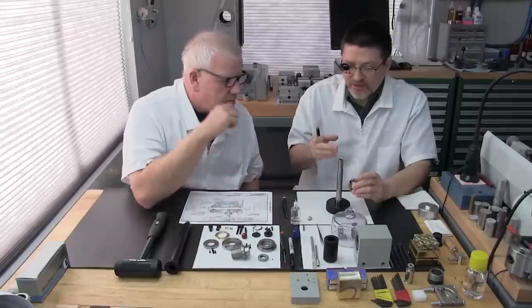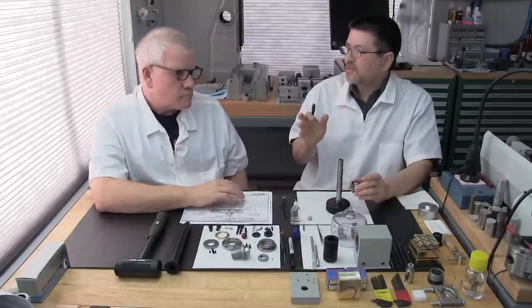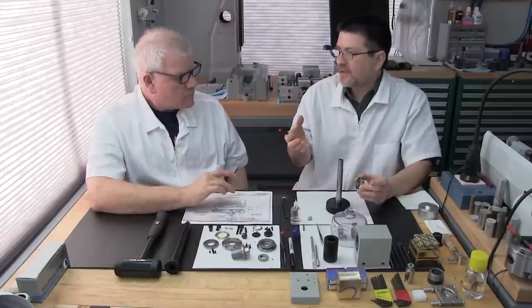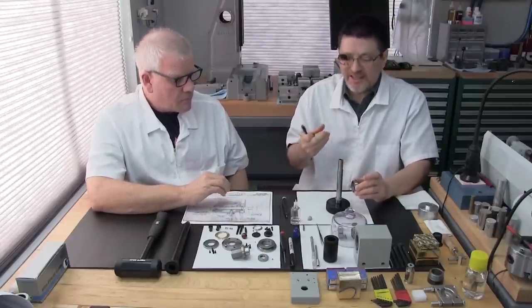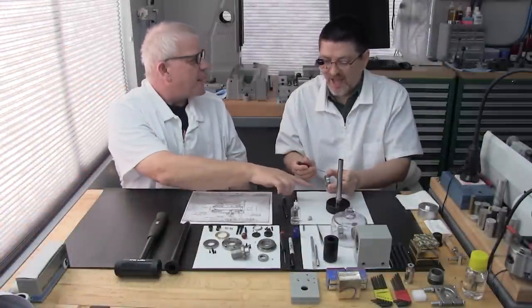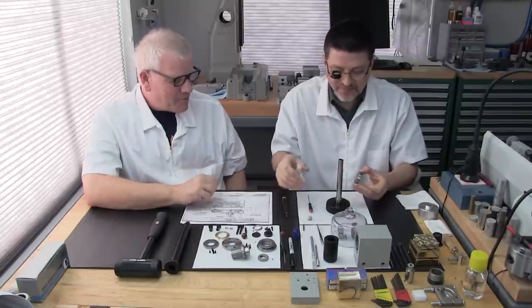But on the other bearings, you will find these arrows. Again, not 100%, because when we did the 3C assembly, that's a 7005 bearing, pretty large for the 3C spindle, and that didn't have the arrows. So it's not always guaranteed. But in this case, it's a 7003 bearing, and I noticed that the arrow's wide area is the back, and it points to the back. That's right. So that's your back-to-back, back matches your print claim. Exactly, I just want to point that out.